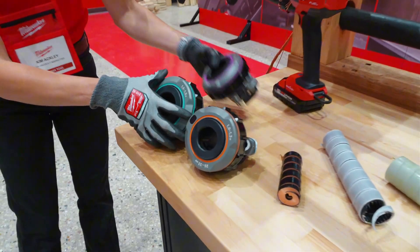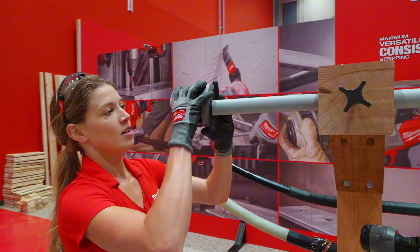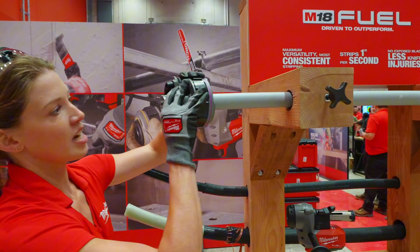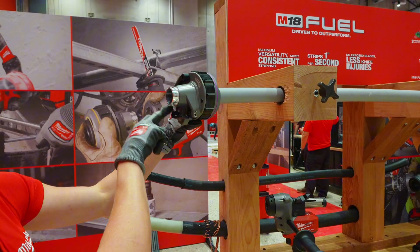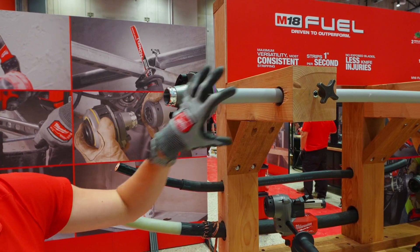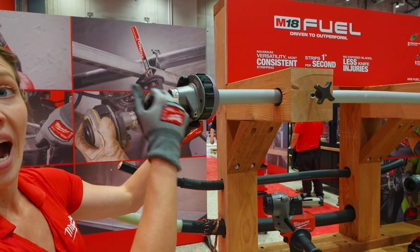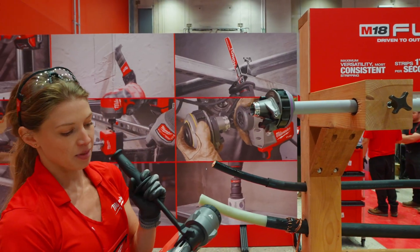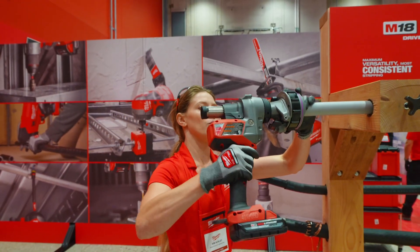Let me give you a quick demo. This is a 795 35 kV spacer cable. You would first adjust your outer diameter setting it onto the outer jacket of the material. I already set my blade earlier — it's a sixteenth inch away from the highest peak of that internal pickup. I'm going to keep the depth gauge on for this and set it at two and a half inches. Quick connect on the spool.